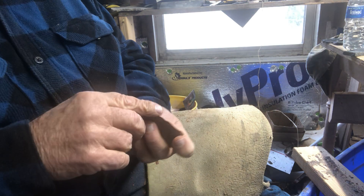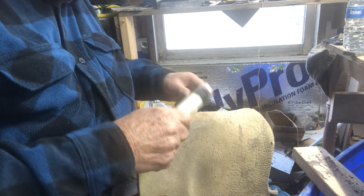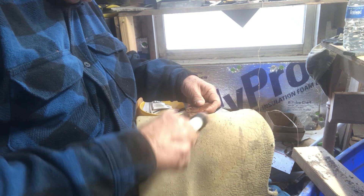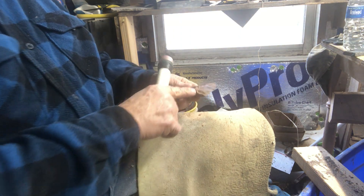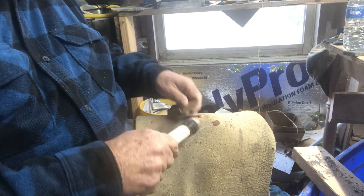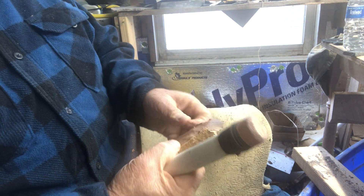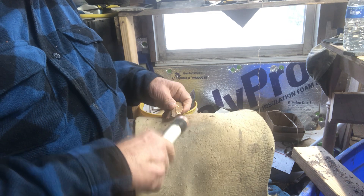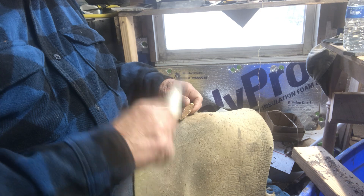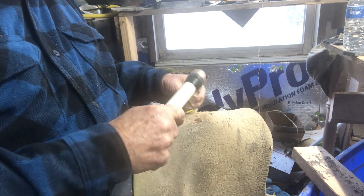There's not much shock going in now — I'm working on this razor, hitting straight out on it, just moving it that way. I'm trying to hit very far in, straight out. I'm going to turn it over — no grinding or nothing, just a little razor hit, hitting straight out on it. Now it's starting to get thicker because I'm pulling it toward where it's thicker, and I'm going to keep hitting on it to get it just a tad thicker. Now I'm having to hit on it a lot right here to break through that chalk — I'm just barely hitting on the edge because I don't want to put a lot of shock in it.